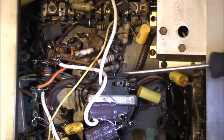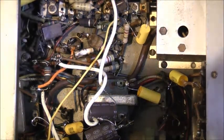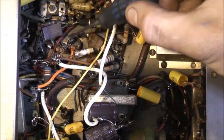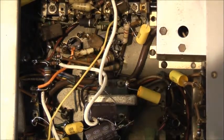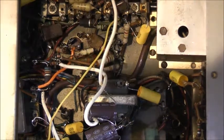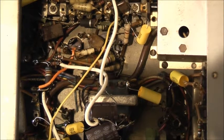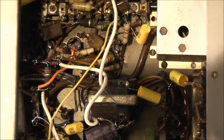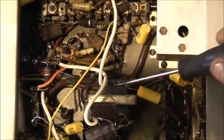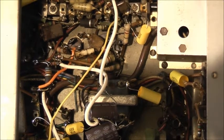So I said that the capacitors I changed, I couldn't find a can type to replace it and do it properly, other than going to Antique Electronics Supply to find a proper one. Nor would they fit inside the original can to restuff it, so I've had to do it this way. I could have done a bit better using a terminal strip or something, but that will do for now. It seems to be okay. It's not the neatest way to do it, but it works. Now I'll see what that does. But I'm thinking it's a little bit more to it than that.